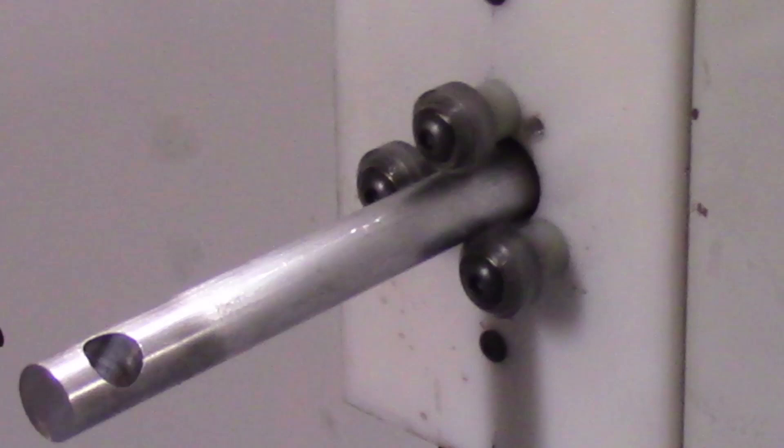This was a temporary design to minimize the whipping action of the bars on my lathe. I am currently working on an updated design which will use the same three roller bearings, but on adjustable arms to permit easy adjustment for different sized bars to be machined. As I develop and produce this new design, I will produce a YouTube video on it in the near future.